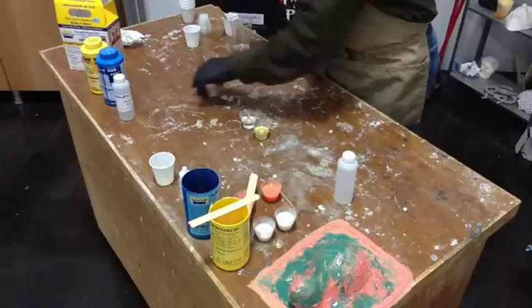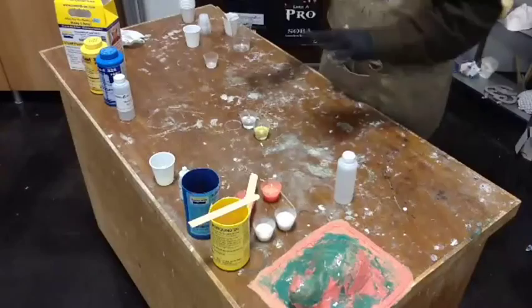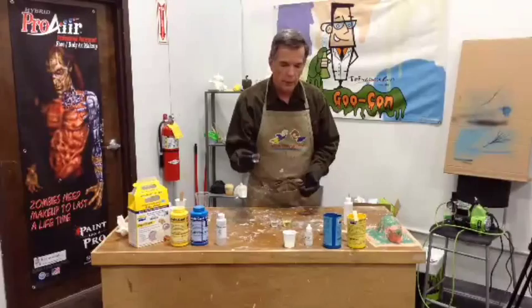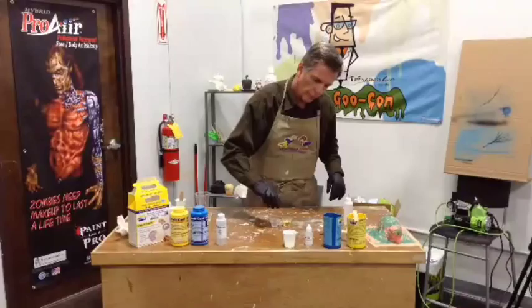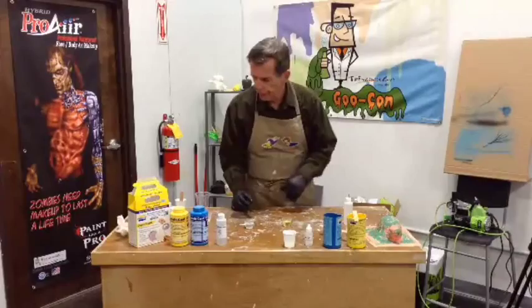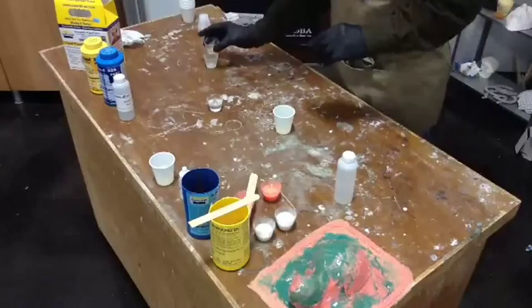Okay. Now, this will be the Doxy 5 version. Notice three cups. I previously weighed out approximately 5% of the total mix. That's the number we're going to go with. I'm going to apply proper mixing rules, which is anytime you're tinkering with a urethane, you tinker in the B side. So we're going to dump this into the B side. It didn't really do much to the color. Still looks pretty much like it did before. So here's the A, same old stuff. Glug, glug. Notice I'm starting a very nice little stack of cups here. Here's the B.